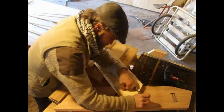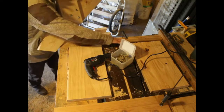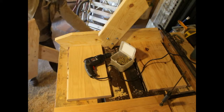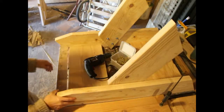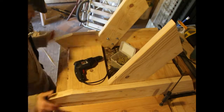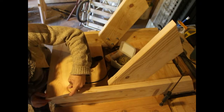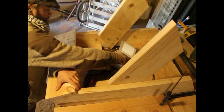Once the sides are made I start assembling the chairs. I start with the back, putting them down on what will be their front face. I'm using the wood I cut for the seats — which are three inches smaller than the width — as spacers. I set these in with a square stop at the back so everything is nicely lined up and square. Then I grab one of the backs, add some glue — if you're going to use this outside, use Titebond 3 so that it's waterproof. I line this up, add two pilot holes, and put in a two-inch screw. If I were doing this again I would spread the screws a little wider for more lateral stability, but with the glue it won't make a big difference.